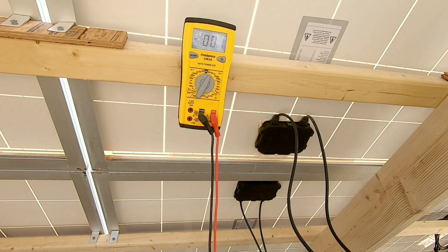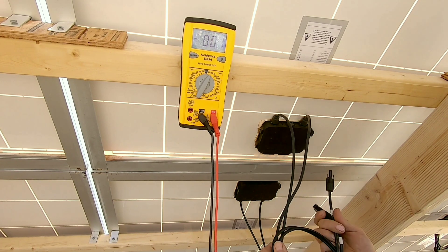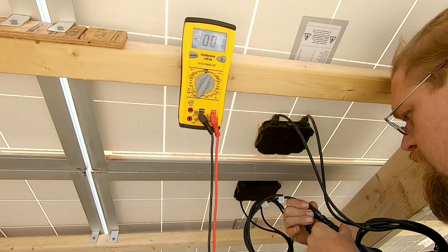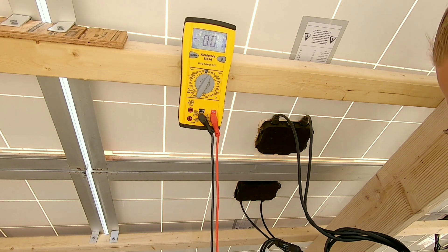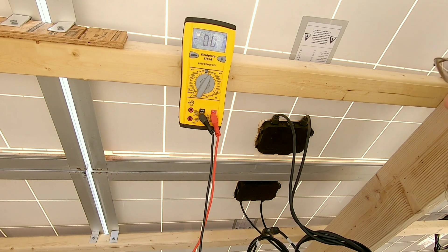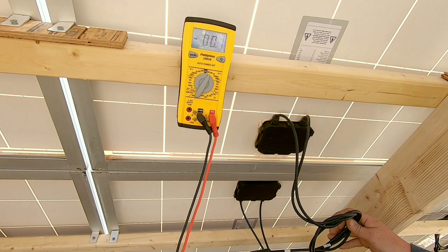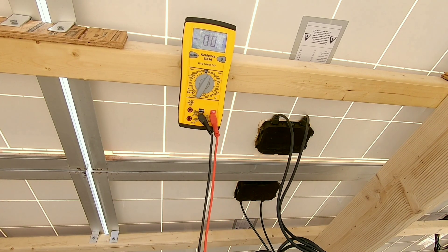Let me get these tied back up here where they were, positive to negative, current going in. So now we have these two. I'm going to double check — 80.3 volts. Okay, we're good — 80 volts. Now I'm just going to run through and link them all together like that. I'll figure out how to tie these up later on down the road — get the wiring, conduit, or whatever I'm going to use when we decide how to do everything.